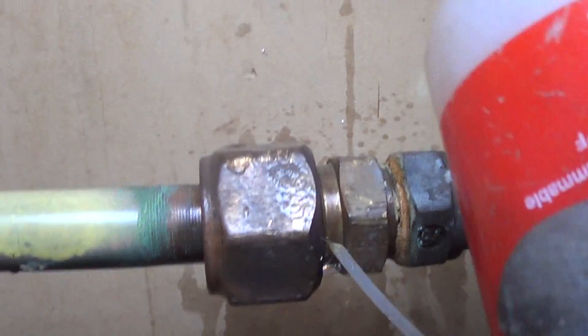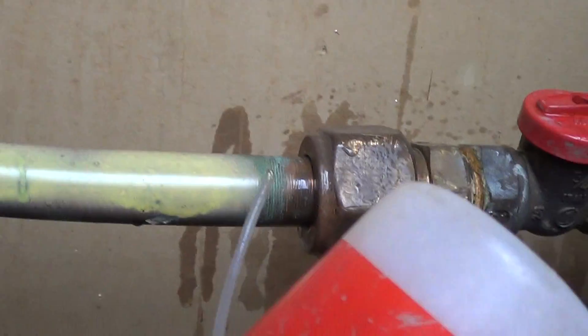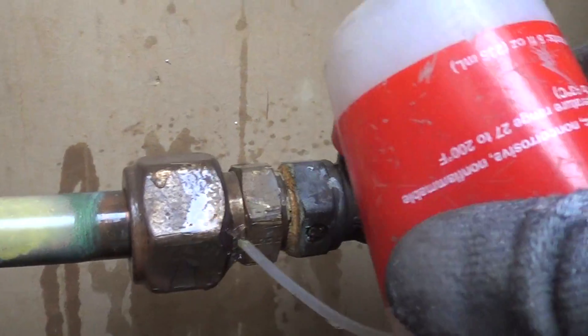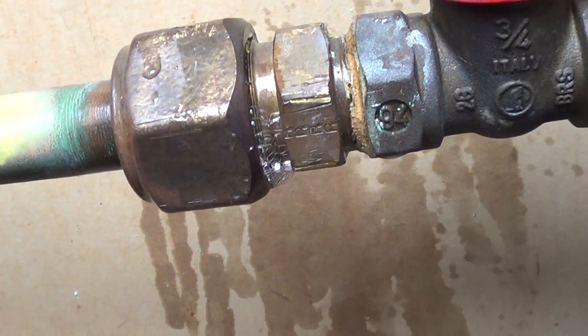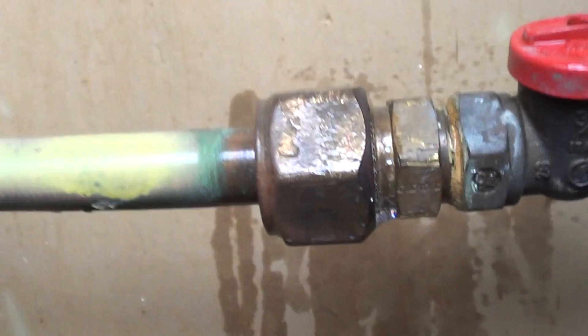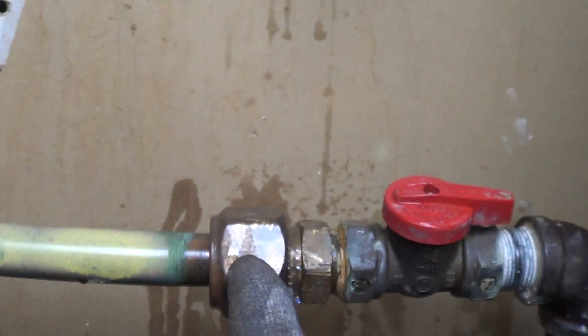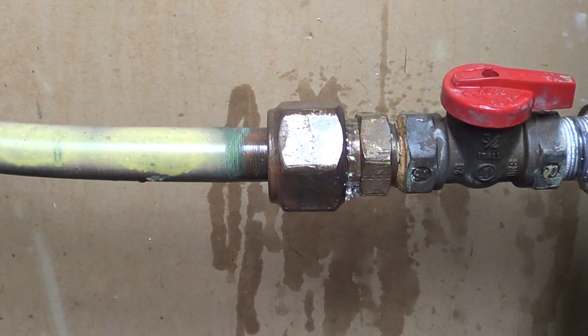And then down here — flares are the hardest to check, because you've got to fill in a big gap where the threads are and you can't actually get to the seal. And you can see right there how the bubbles grow on that. On that flare it should have been pipe doped on the actual mating surface, and that wouldn't have been leaking there.